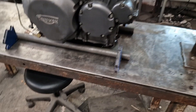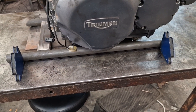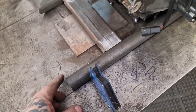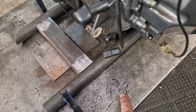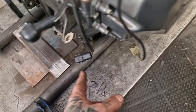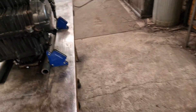So now what I do is offer these tubes up to the sump and come to an agreement. We get to the widest side and then move it out a bit, then measure. It works out four and three-quarters from the bench, from the edge of the bench. That's going to be symmetrical to the bike — bang on in the middle.